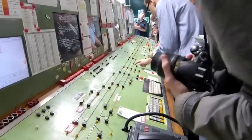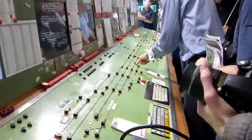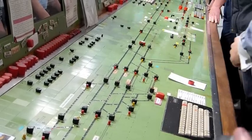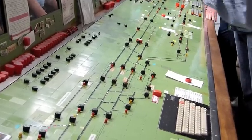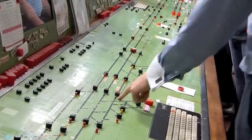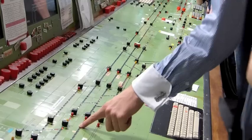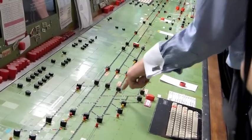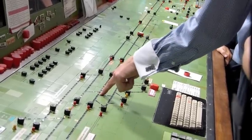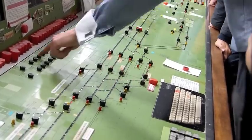To be honest, from what I've studied of this panel on photos and things, there's a lot of these dots missing, and some of them I think - what on earth does that dot mean? It's just a tile that somebody's found and put in. For alternative routes - coming from platform three up the main, you can go through either of these crossovers to get to the up main. And there's presumably a preferred route? The preferred route is the non-preferred route. So the interlocking's preferred route is to go this way, but that's not the way that we like to go - we like to go this way, because that is an overlap for this one, and it means you can come up the main all the way there while you're sticking to there. So if we're not using three, four, one points in reverse, we always keep normal.